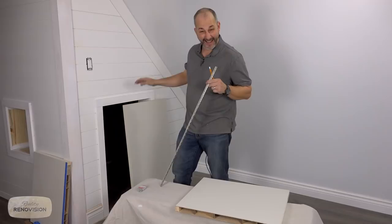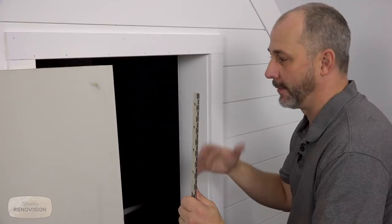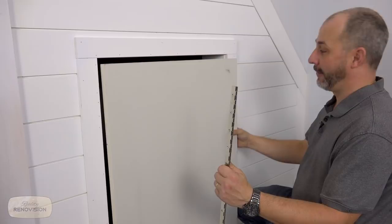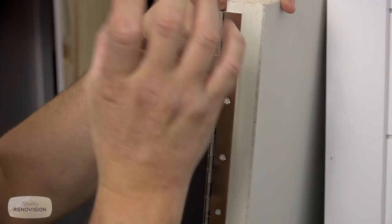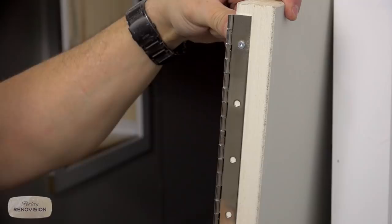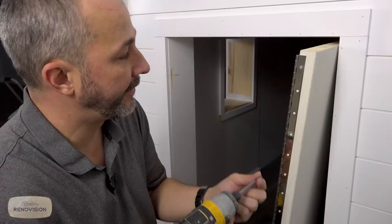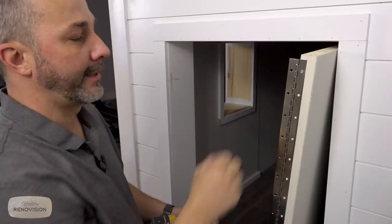Because this door is so small and it's just made for access under the stairs, we're going to use a piano hinge to install it. The most important aspect of this little fake child's house is the front door — it's important to make it look like an actual door. So we're going to put this little cut-down door in the space and add a nice handle to it, but we're going to paint it over solid red so it kind of looks like a cute little home. This piano hinge comes from the store in various lengths — we just picked something that's going to work with what we got. We're going to set this hinge in the fully open position so it sits flush on this corner, and that'll help you identify where you're installing it. Now, there are a lot of holes here. We're not carrying anything with any weight, so we don't need to put a screw in every hole, but you do want to alternate so that the screw on this door is not the same location as the screw on the other side going into the jam, or you're going to have too much restriction there.